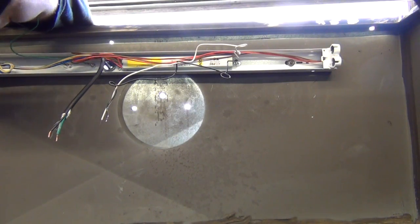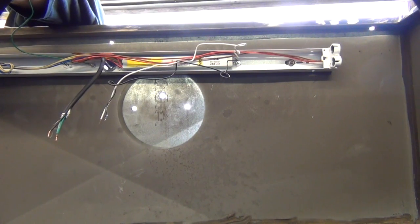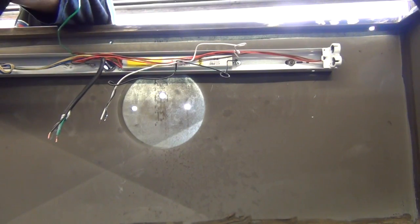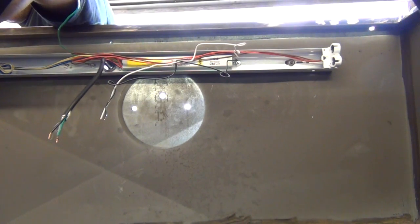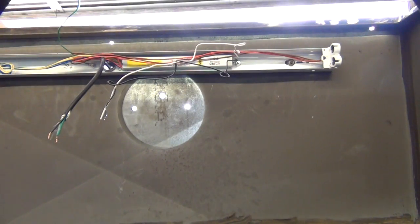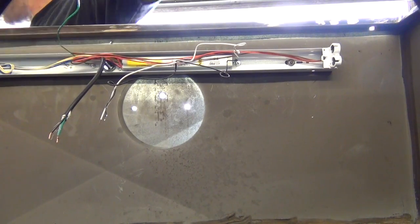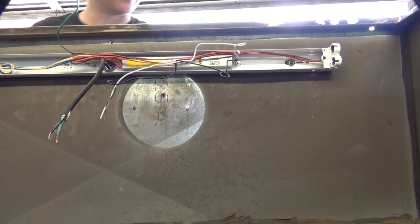First thing I need to do is take a knockout out. Originally, I went ahead and grounded the green wire to the box using a bolt that mounts the light fixture. Then I found my cord that I'm going to use, and I forgot about it having a ground wire in it, so I'm just hooking my ground to it. Wiring up the light fixture is really simple.